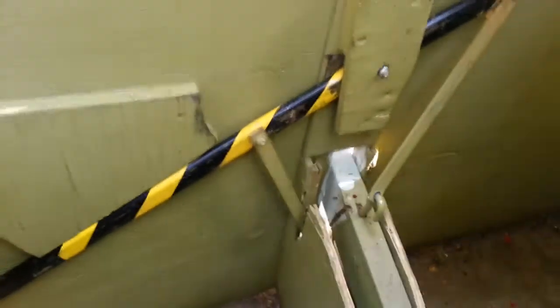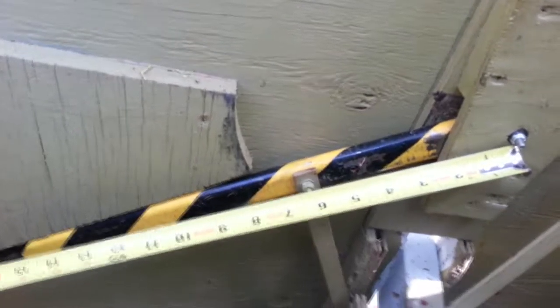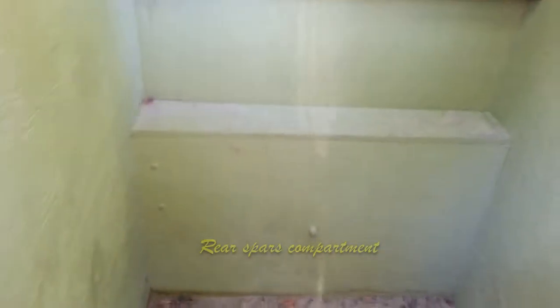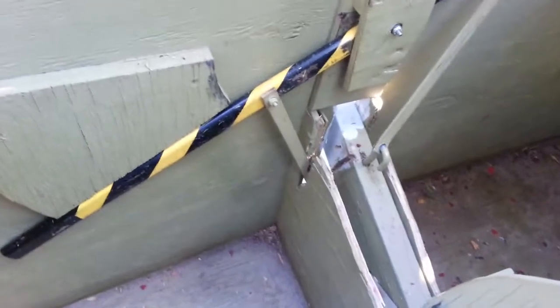You can see that this lever pushes down on the front pivots and pulls up on the back. By trial and error, the rear pivot is about 6-3/8ths and the front pivot is about 6-1/8th. Bar stock goes from the lever down to each spar, and the spars are hinged in the middle. There is another spar at the back of the cockpit under the machine guns that is also hinged in the middle, but it doesn't have the wing fold actuator — we are just actuating the front spar to make the wings fold.